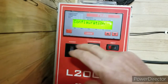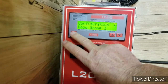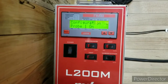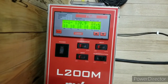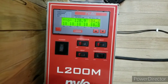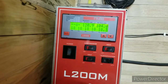Now I'm going to turn them all back on again. Everything is going nicely. When this started two days ago, the moisture on those probes said 20 and 21%. Now I've gone down to 18% — down about three percent. It basically started drying yesterday, so that's telling me it's losing about three percent per day, which is pretty good.